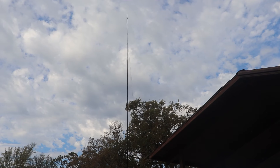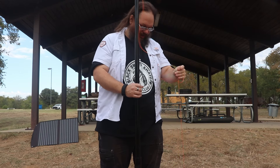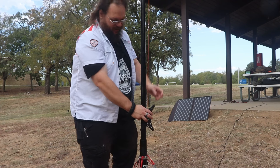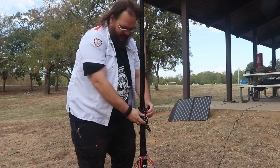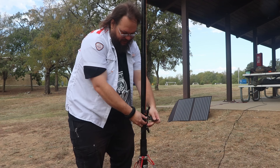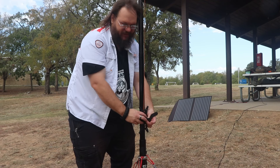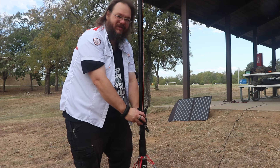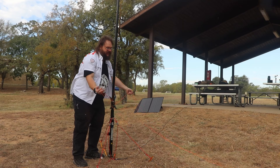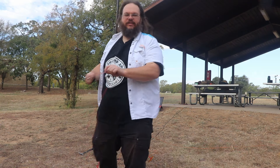That's all the wire right there — we want this sticking straight up. I'll drop it one more section — yeah, I like that. Now I've got the mast all the way in the air. I'm going to take the velcro and velcro the antenna assembly to the mast so it's off the ground and not getting dirty. I think that's smart, but probably someone in the comments will correct me. And now 17 feet of radials in all four directions.